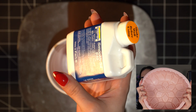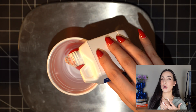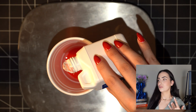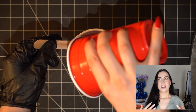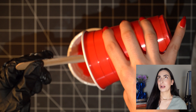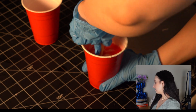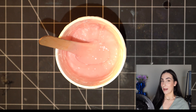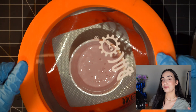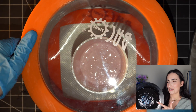The glossiness of the epoxy did translate onto the actual mold itself, so you can see inside the mold that it does have a glossy finish. The thing is with silicone, if your surface is dull, that is how it will transfer onto the silicone — all the markings are very transferable. So you have to make sure when you have something that's 3D printed that it's post-processed to the max, because every little imperfection will be transferred over.